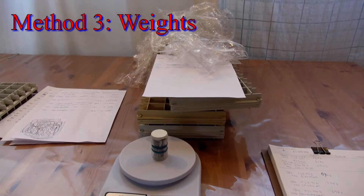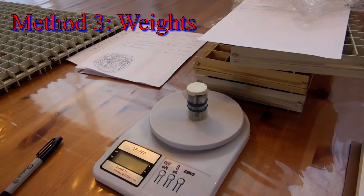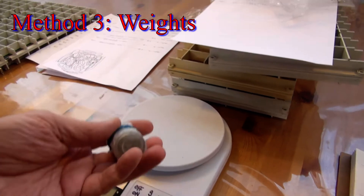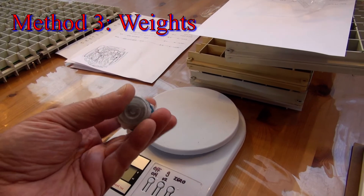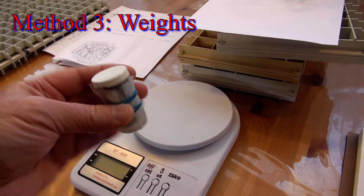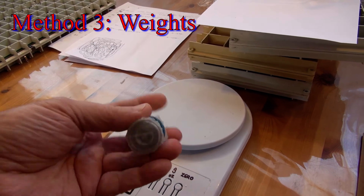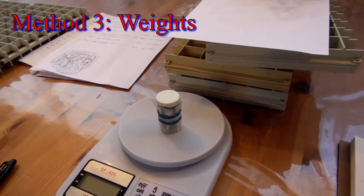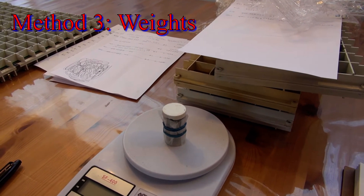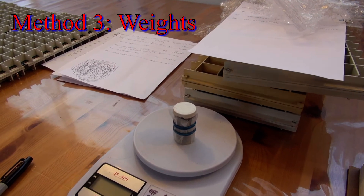The third method is to actually use a weight to see what the tension on the diaphragm is. What I've done in the past, and will do for all of these panels again, is to use a weight protected by a plastic film on the bottom. You place it on the diaphragm in one of the two middle sections and when it hits the stator, whatever that weight is is what I need to reproduce.